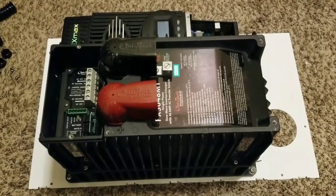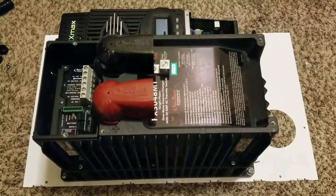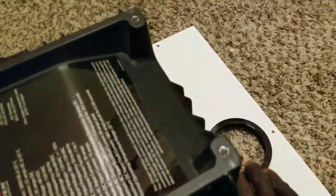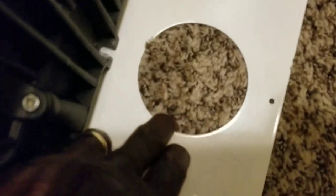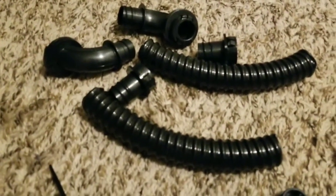As you can see, I'm ready to take this part — it's already unbolted on the door and everything is already mounted. I have what looks like an o-ring, and this one's going to be sitting right there so that the ends — which are sharp — don't cut the wire from movement over time. That's why you have this sitting here. I still have to knock out and punch these out, and install this for the AC in and AC out wires.